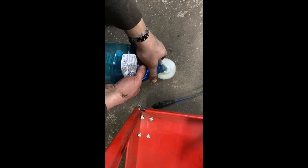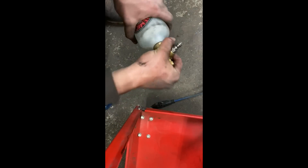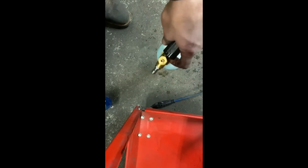Out here on the west coast we're blessed with really dry air — you can leave stuff unprotected for quite a while before rust happens. If you're on the east coast or midwest with high humidity, you need to get that oil on there as quick as possible. All I do is use WD-40 — I spray all the machined surfaces to prevent rust. I try to avoid the block and anything I'm going to paint so the paint will stick better. Let's get this rolled outside and cleaned up.